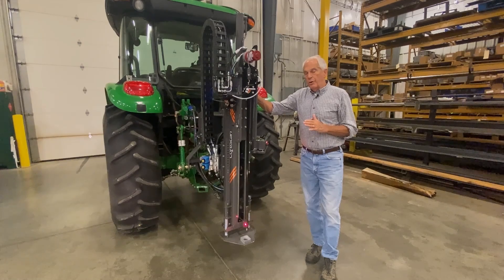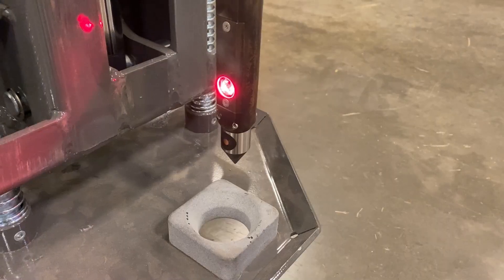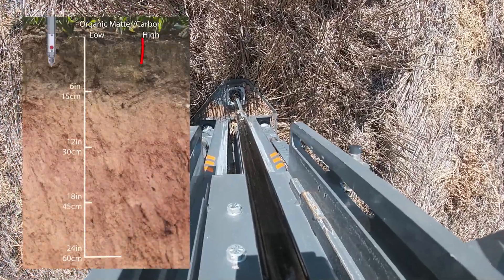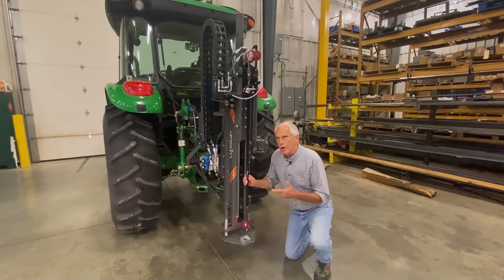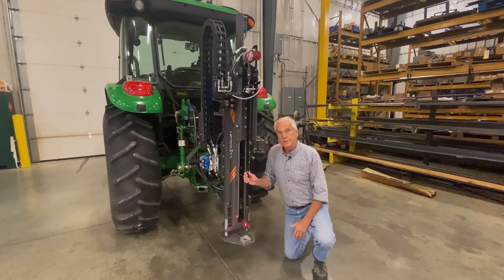But the most important part of the probe are its sensors. You can see that the optical sensor — it's a red and an infrared optical sensor that measures the soil reflectance, which correlates well with soil carbon. So as the probe is inserted into the soil, it's continually taking readings, so you see exactly where that topsoil depth changes. So if you're mapping carbon or your soil health, or you just want a good topsoil depth map to be able to do variable rate inputs based on productivity, a topsoil depth map is really something that's never been available before, but it is now with the core scan.